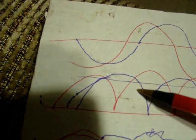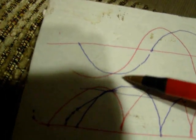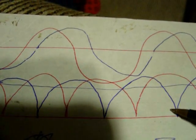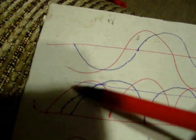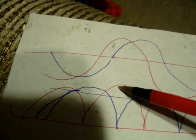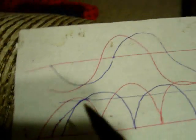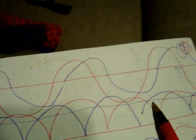Now with phase two added to it, you've got this. While this is going negative, with the diode it makes that positive. Here's positive here, it's positive here. Here's negative here, it's positive here. When you put these together — here's this wave turned positive, half of the wave turned positive, this half turned positive, this half turned positive. Notice that your charging voltage, when these are put together, is never at zero. That's the wonderful part of it all.